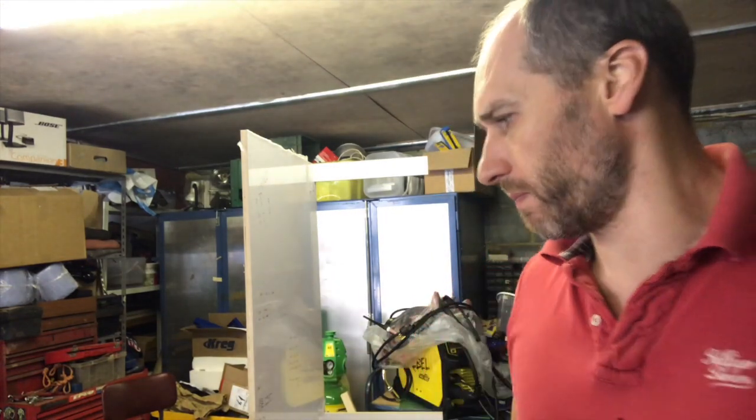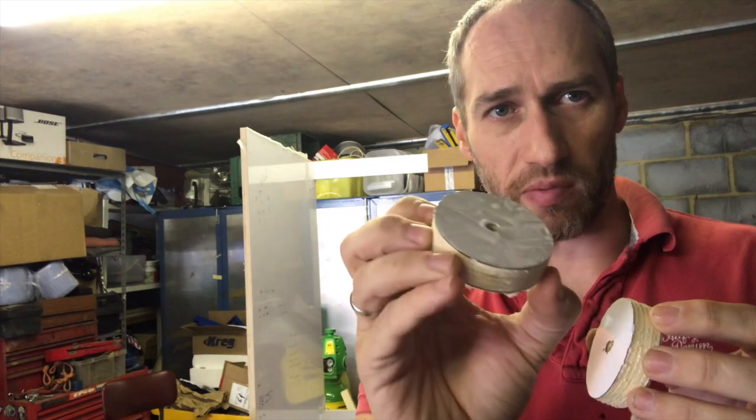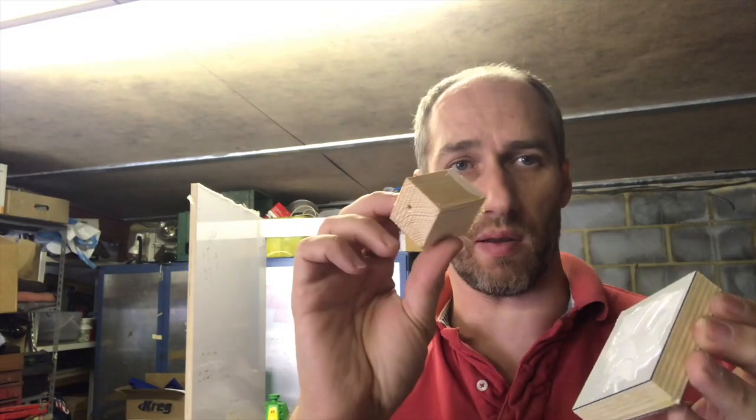So I'm going to do a little glue test. It doesn't say melamine-to-melamine - it says melamine wood glue. But I'm going to test melamine-to-melamine using a bit of scrap. I've put some glue on and I'm going to stick those together, clamping them lightly to simulate real-world conditions. Then I'll also do a test of melamine-to-wood - just a bit of pine - and lightly clamp those together as well. We'll see how they both turn out.